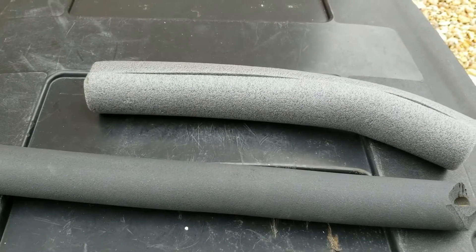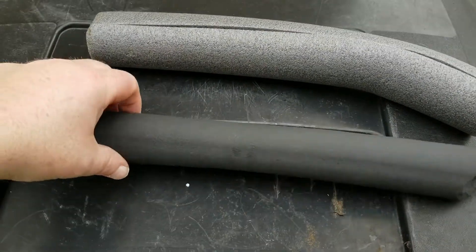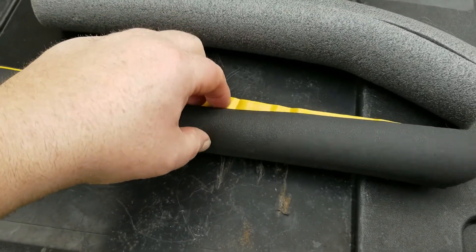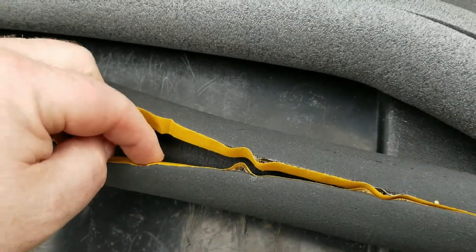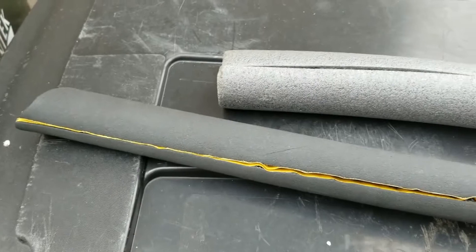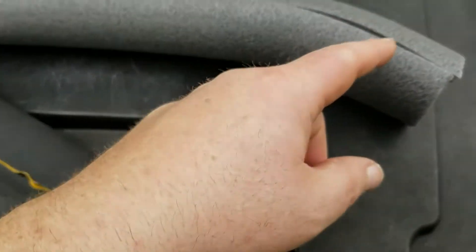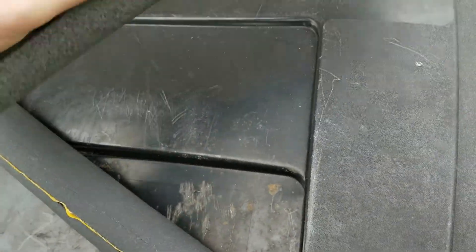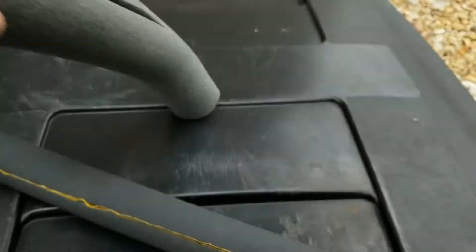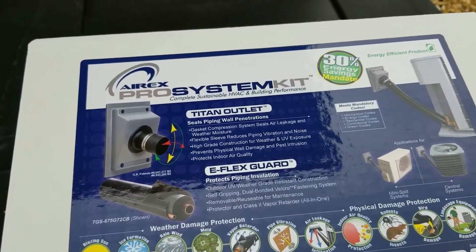Before I show you the new product, I wanted to tell you exactly what kind of insulation to get to wrap those copper lines going in and out of the HVAC unit. You want to get this soft rubber piece of insulation that's split down the side with tape right in there. Just peel that tape off and slide it over the copper tubing. Don't be tempted to cheap out and get the cheaper foam insulation — it doesn't have tape so it won't stay sealed up, and it doesn't do as good a job as the rubber. And I know this type deteriorates really badly in the sun.